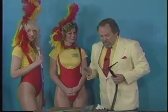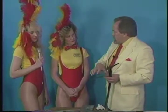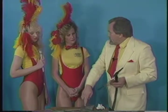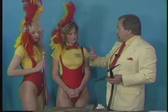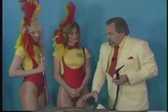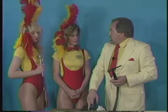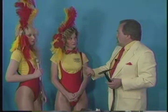Yeah, I guess. Okay. Now, that's part of the problem, is that we're going to flood the area of the weld with argon, and in effect, the piece that you're welding, at least where you're welding it, thinks it's on another planet with another atmosphere. Now, does that make sense? Yeah. Okay. But that doesn't instantly get rid of that oxide. The oxide is still kind of there, it's just that a new oxide won't form.